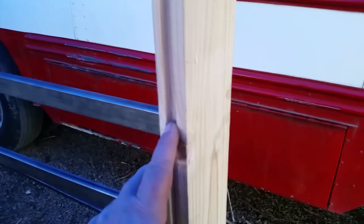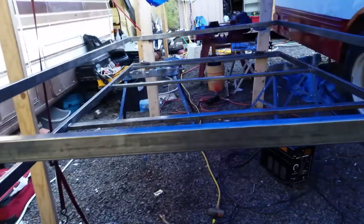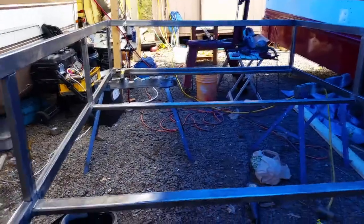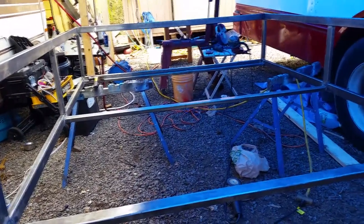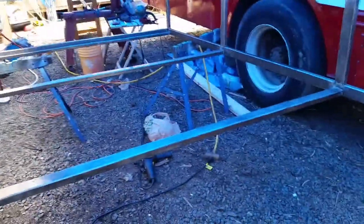Here's how I'm doing this — I put these boards down, they're 2x6s. I was going to use these for making a table, but I'm glad I didn't make the table yet because they've come in handy. I clamped the base and I'm just using clamps to raise the uprights up and into position. Here's how this is coming along — I've got the uprights connecting the top and bottom attached into place, and I'm about to weld those. Then this frame will be done except for the mounting hardware, which I'll be doing next.